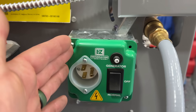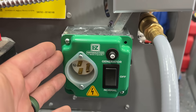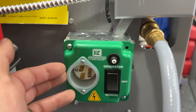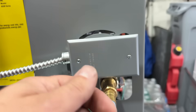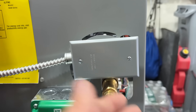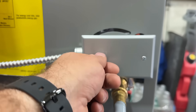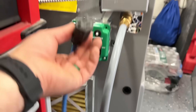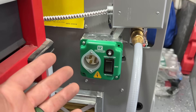If you don't want to spend $88 on the Easy Generator Switch, you can accomplish the same thing for about $20, and I'll leave that video linked at the end. Basically, you put an outlet with a pigtail that goes to the furnace. In the event of an emergency power outage, you unplug the male end of that pigtail, plug it into the female end of your extension cord, run it out to your vehicle, and you can power your gas furnace.